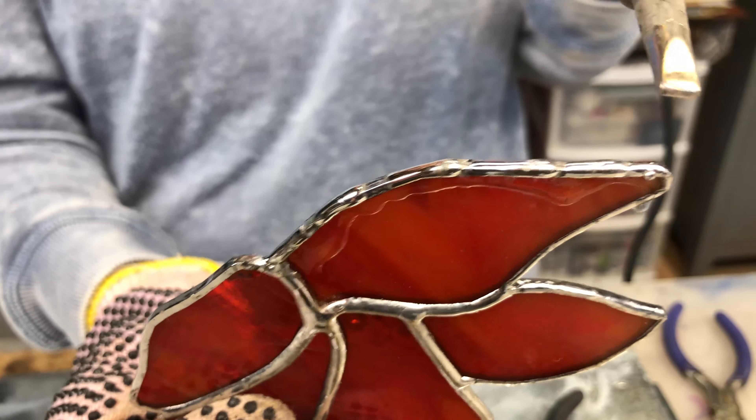Now that I've got it all applied, I want to go back and smooth it out — I'm just going to do a little tapping. I'm going to stop right there because the piece has to turn, and I want this to solidify before I turn it, otherwise it's just going to drip down. Now I can turn it, go to the next curve, turn again, and I'm done. Now you can see the nice rounded edge versus a flat edge — that's how you tin raw edges.